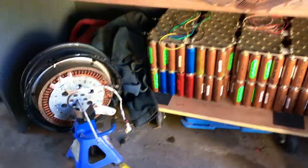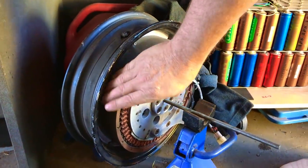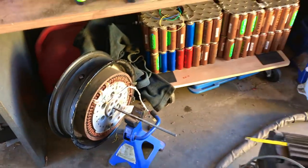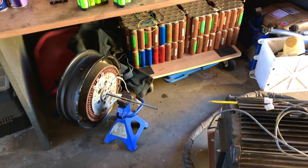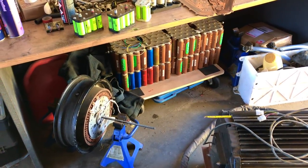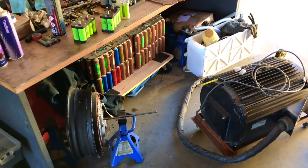Back in the day it was the latest thing. This is one of the hub motors on this side, and there's another one on his side — two big hub motors. These were spinning independently of each other, both connected to a drive shaft and then to each front wheel completely independently. Had the same 200-amp controllers I'm putting into this kart.